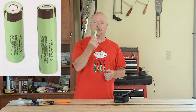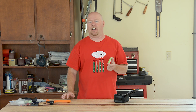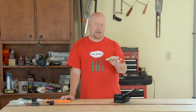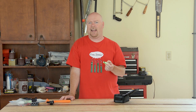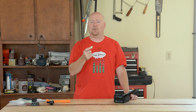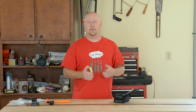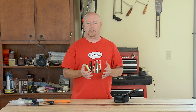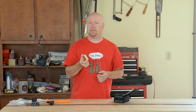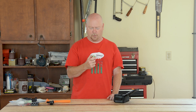This guy right here — the 18650 if you look it up by part number — is one of the more popular sizes. This is a pretty big battery: 3.7 volts and 3400 milliamp hours, 3.4 amp hours in one package that is 25-30% bigger than a AA that doesn't have half of that capacity. The prices of these things have become much more reasonable in recent years. This particular battery still runs about 10 bucks on Amazon, but that is because it is one of the highest capacity 18650s you can buy.